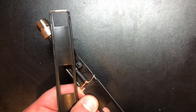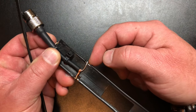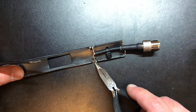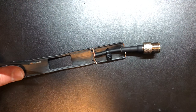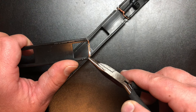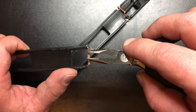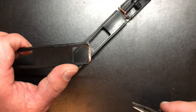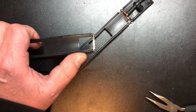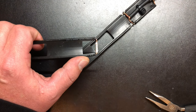I just put this on the meter and it was a little off. I ended up raising the wires toward the front of the antenna, which helped a little bit. Then I ended up trimming probably another quarter inch of insulation off, and now you can see we've got quite a bit of wire exposed — about three-eighths of an inch on either side shortened. Now we're pretty much resonant. I could tweak it a little more, but I'm going to leave it. Let's go outside and throw it on the analyzer and I'll show you what it looks like, then we'll come back in and tidy it up.